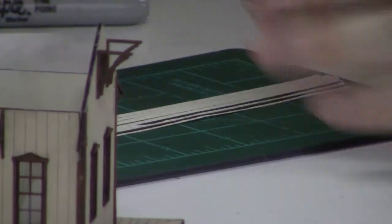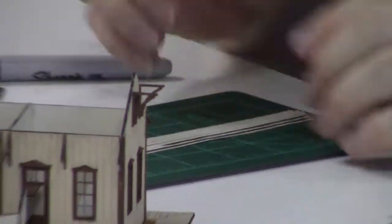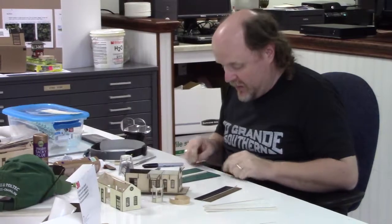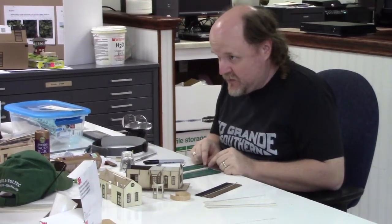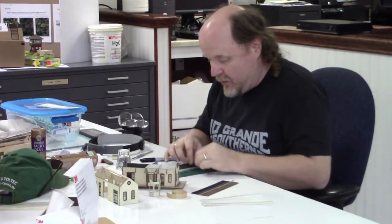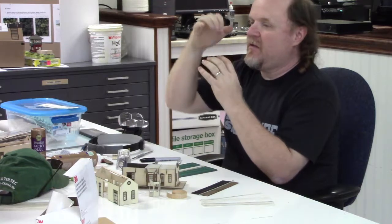What you do is you get the rows of cedar lined up like this, and then you take the chart tape, start at the very bottom, and put a row of chart tape across them at a 90 degree angle. Then you come up the width of a piece of chart tape, leave that blank, and put down another row, and blank and another row, until you get all the way across. What you end up with is kind of like the flexible top of a roll top desk.